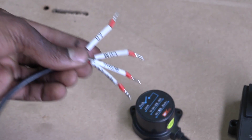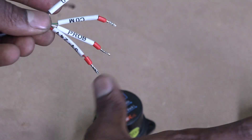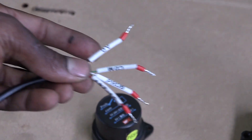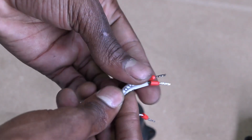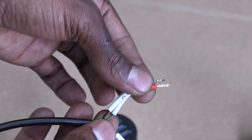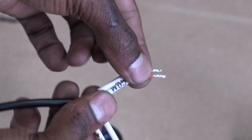Now let's talk about the wireless tool pre-setter installation. For the wireless connection you'll need to know that because it's a normally open circuit, you're going to need to bypass something. Your COM and your ground are going to need to go on one port — which is any ground port you have on the motherboard. Find anything labelled GND and put these together.